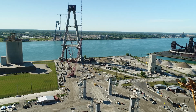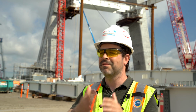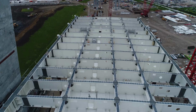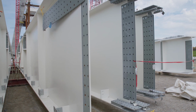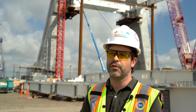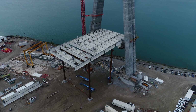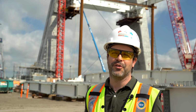On the side span, the bridge is not exactly symmetric on either side. It's almost symmetric, but not exactly. On the side span we have 26 segments, and on the main span we have 27. And those segments are typically 15 meters. The supplier here is Canam. They are delivered by Canam, our steel supplier here in Quebec, in Canada, that provides us the entire steel of this bridge.